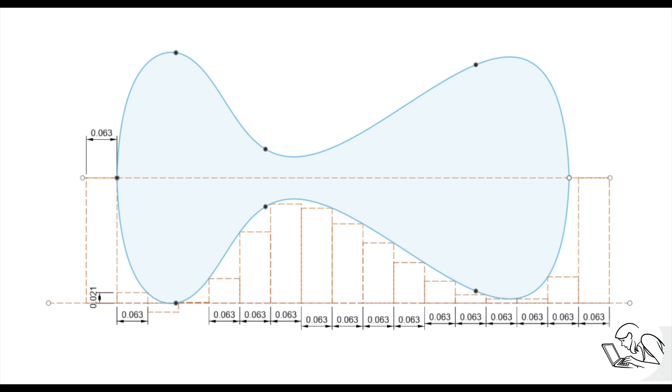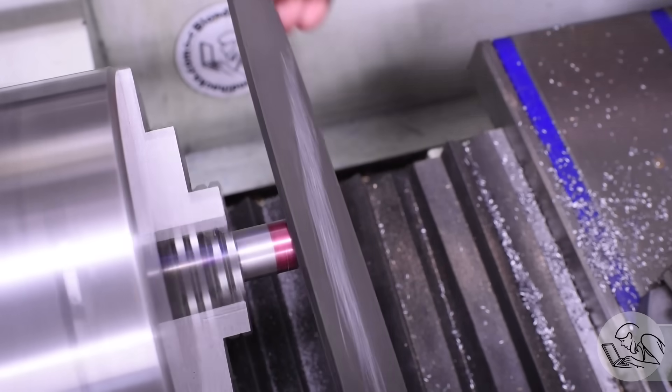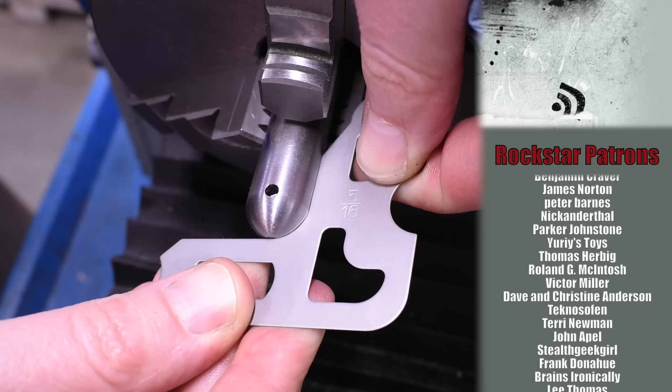I've demonstrated a simple hemisphere here, but it's certainly not limited to that. This technique can be used for any complex series of curves — if you're making chess pieces or other complex curves, the same method works just fine. If you're doing concave surfaces, you're going to need smooth round files that can be used on the lathe to get in there, and you're probably going to want to make a cardboard template or something to match up the curve, the way that I used the radius gauge for this curve. And of course, there are plenty of other ways to make curved features on the lathe involving fancy tools — a boring head on the milling machine, form tools, or ball turners — but this method you can use with stuff you already have in your toolbox, on any lathe, on any material. It's really quite easy. I hope you found this useful. Thank you very much for watching. Thank you to my patrons who make all of this possible, and I will see you next time.